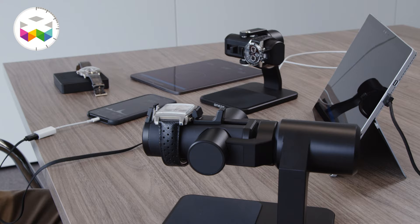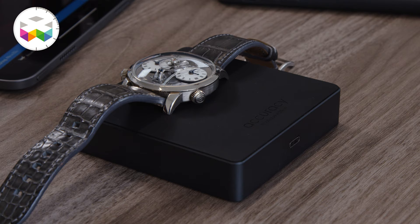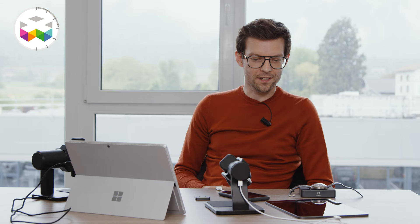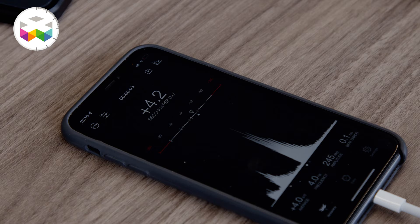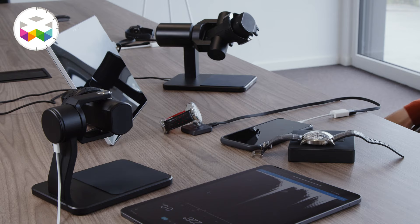There are a lot of different ways to measure accuracy or precision — there's a slight difference between the two. There are different methods: rays, laser, vision. Today we're going to talk about acoustic. It's quite easy to understand — basically, when you wear a mechanical watch and put it on your ear, you can definitely hear that tick-tock sound. And with specific algorithms and signal processing, we can extract from that tick-tock sound the main thing we want to know: the accuracy.